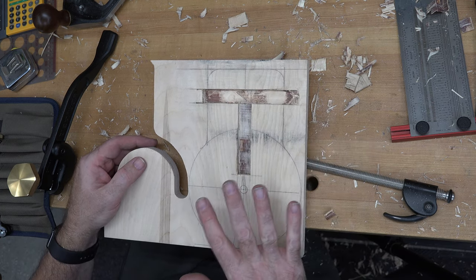There is our gusset installed. Now there's only one piece left to make and that's the backer. For that we're going to need more plywood — we're going to cut it eight and a half inches long and we need it the same width as our back section of the table, which will be four inches. So let's cut a piece eight and a half long by four inches wide. Just like we did on all our other sharp corners, we're going to use a one and a quarter inch diameter template and round two of the ends. The other ends will be inside the dado of the fret saw table so you don't need to round those, but the exposed ones I'm going to take to the belt sander and round them off.